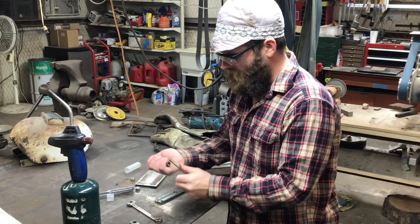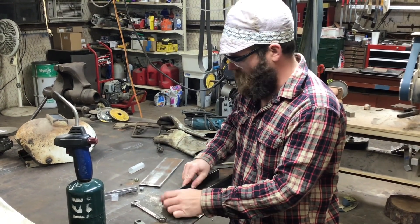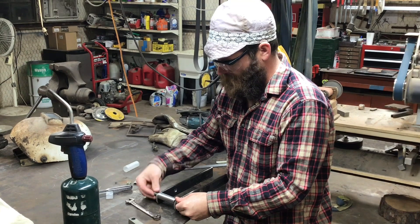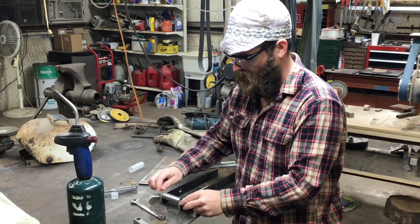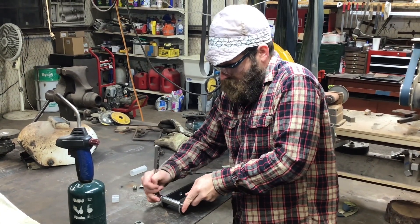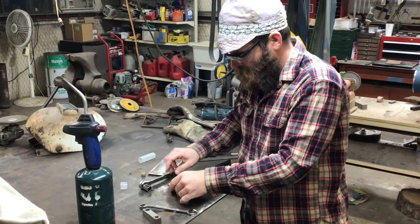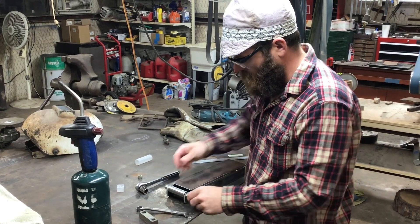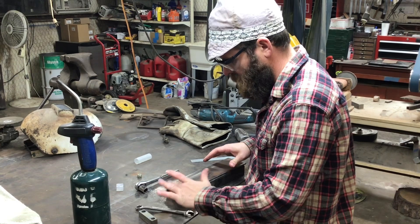What I'm going to do now is put this whole thing together and line up this top plate to be flush with the bearings, which is really important. When we finish up, we're going to put a lock nut on this thing because it doesn't need to be all the way tight — the bearings just barely turn right now with it hand tight. I'm going to tighten it up just a little bit to straighten everything up, and that gave the bearings some play. I'm going to move this maybe just a 16th of a turn to give it a little more play so those things roll easily.